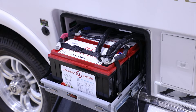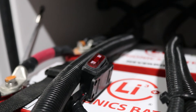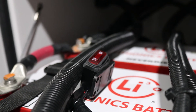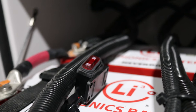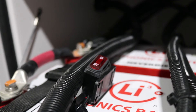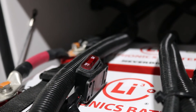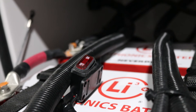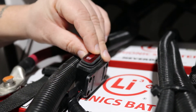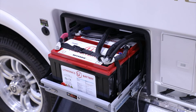It does not have an internal battery heater, however. So with this one, you would have a battery heater mat. That mat will be located underneath the batteries with a switch on top that you will have to manually turn on and off. The only time the batteries have to be heated will be when you're looking to charge the battery in freezing conditions, or if you're in really, really cold weather conditions, even when using the battery.